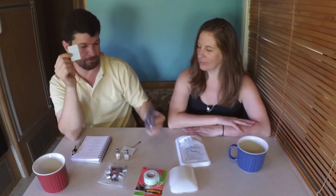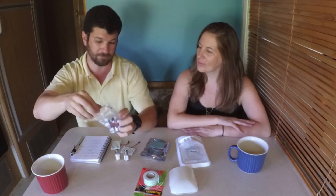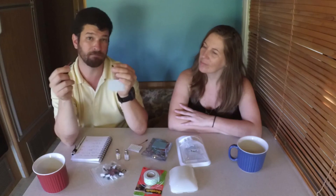So 70 SMD LED panels are what we went with. I've got a bunch of these bags - that's how they come, in a bag with a little male prong at the end, and you get a bag of adapters to pick the right one. Be careful, as these aren't the best solder jobs on the wires to the adapter. Also remember that polarity matters with LEDs because they're a diode, so you can plug this in backwards. If you plug it in the wrong way it does nothing - you think you've got a bad panel, but if you flip the prongs the other way it probably comes to life. I have not had any dead panels.